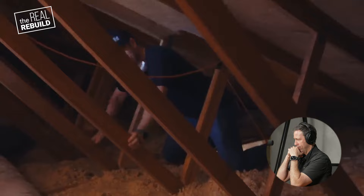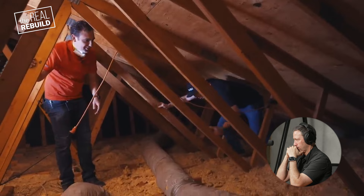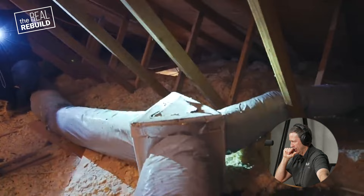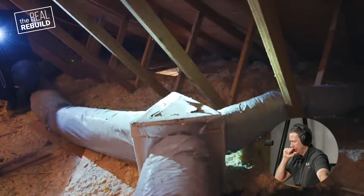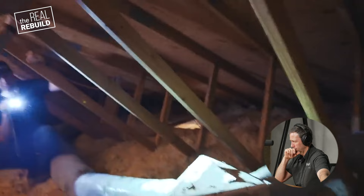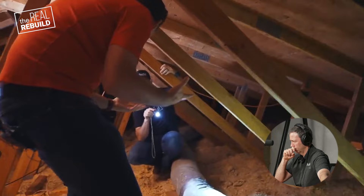They really like eating on the ductwork. These triangle boxes are called cheese wedges — funny that mice like the cheese. They also eat into the regular insulation. He's calling them mice, but let's be honest — these are rats. There's damage from rodents right here. There's a cut on that cheese box — some previous person came in to inspect and didn't seal it back. Duct leakage. You've got cold air coming out of unsealed seams, causing all sorts of issues, not to mention humidity. It's 80-90 degree dew points and all that moisture is going straight in, and you can get moldy ducts.